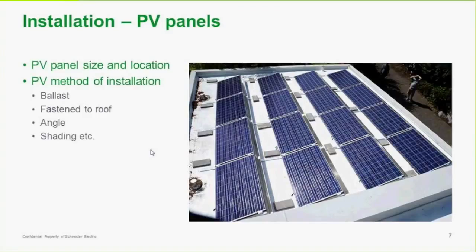There's the installation of the PV panels. Here we have PV panels installed on a flat roof. This particular installation is using ballast, so there were no penetrations in the roof membrane whatsoever. These little blocks are basically cement blocks and they provide weight to hold everything in place. There's actually a wind screen behind these as well to prevent wind from getting underneath them and lifting them up.